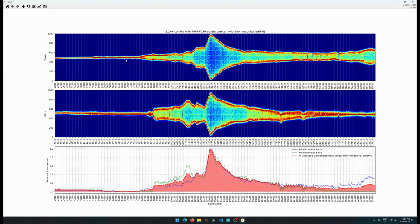And that brings up some other things. This has a bit of drift in it. When I'm aligning this stuff, I get the first set of RPM at 2000 RPM, and I find the midpoint, and then I align and center that way. But that point kind of drifts around, especially over here. We can see it looks like it dips down, and it doesn't do it on just one step. It does it within a range of maybe 100 RPM or so, and same here, it has little blips and stuff. So I'm not really sure what's going on there.